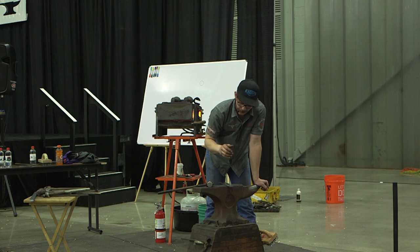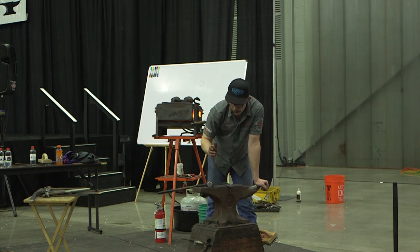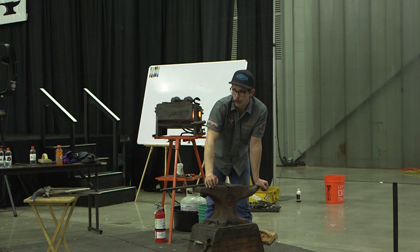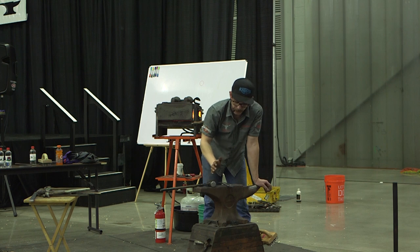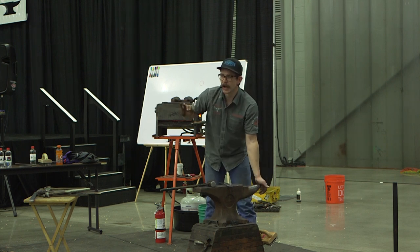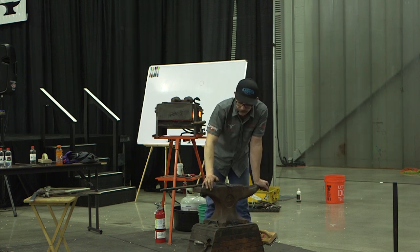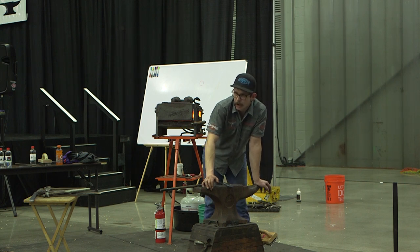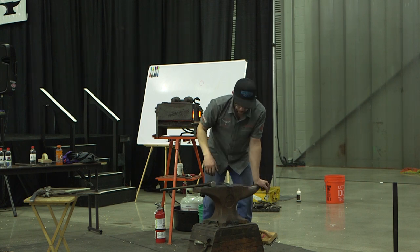So if I'm making tongs for my house and just making some, they pretty much all come out the same size that they're gonna fit. And that's usually about 1/4 inch, because that's the smallest that I'm gonna have to be shooting sizes. So if I come out 1/4 inch, I can always size up. I can size up to about 1/2 inch and stretch it a little bit. After that point, you need to have a little bit of planning going on and forge around that.